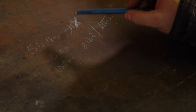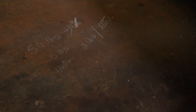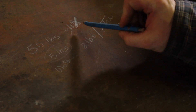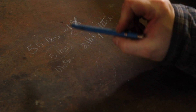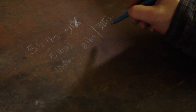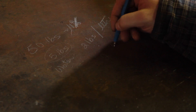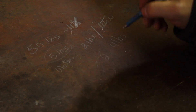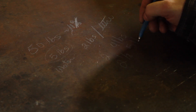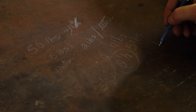I have 50 pounds of refractory. I should add 11% of the weight as water, so that's around five to five and a half pounds of water. Water is two pounds per liter, so if I add two liters that would make four pounds, and if I go two and a half liters that will be five pounds. So I could go a little bit over two and a half — I could probably go around three liters.